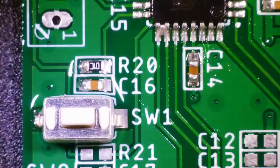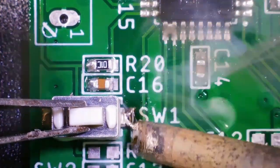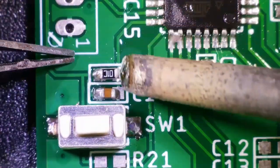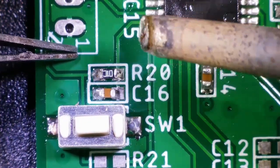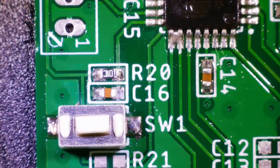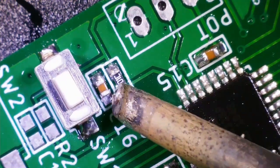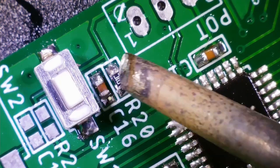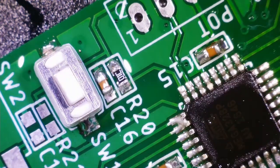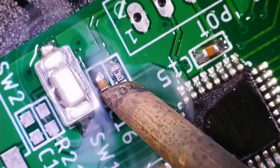And that's the reason why we solder the SMD components first and later we solder the through-hole components, because generally the through-hole components are bigger compared to SMD components. If we solder the through-hole components first, then those components are going to create a lot of barrier while soldering the SMD components. That's the reason we first solder all the SMD components, and only then the through-hole components. Okay, so always remember this point, that will make your life easy, otherwise you will face a lot of problems.